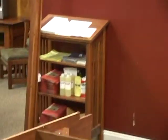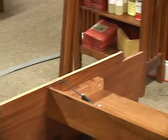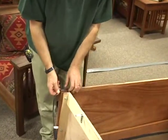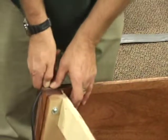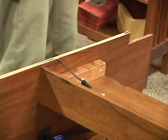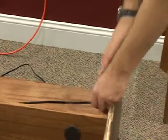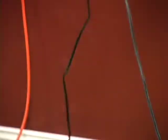Once you have that fastened to the sides, you want to do your wiring. What you do is run the roof wire for the lights down this dado on the side, down here, run it out behind the headboard and plug it into the dimmer switch. From the dimmer switch, run out on the opposite side down here and out the bottom.